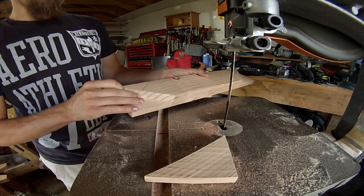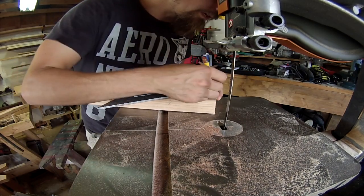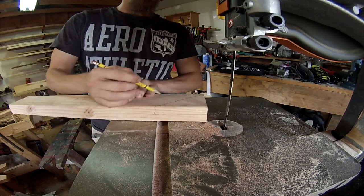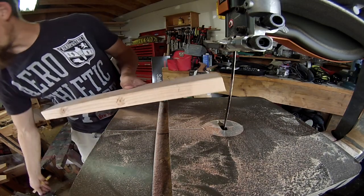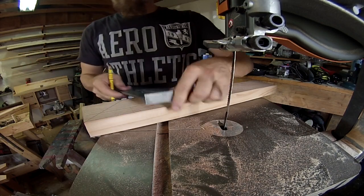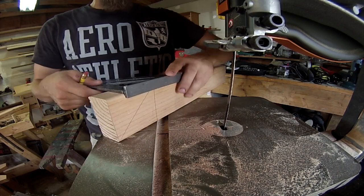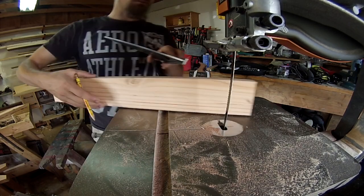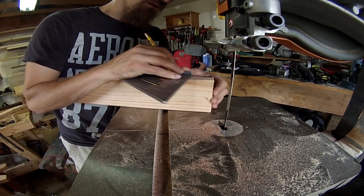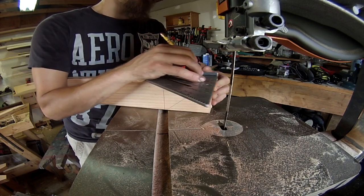Just like that, I've got this piece notched out. Now we can grab the other portion and get that side done. This side is much easier because you don't have to leave as much — there aren't any really strange angled cuts. I made my miter mark, I'm going to make sure I'm three and a half inches in, draw another line, come on both sides, and make sure I've got my three-quarter inch depth. A lot harder to do on the table of the bandsaw, but we're going to get it done. Got that depth mark, and we're going to flip it over and get this depth mark on the other side.